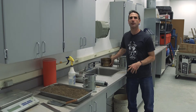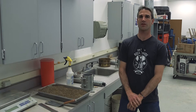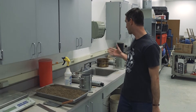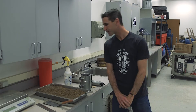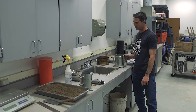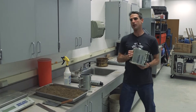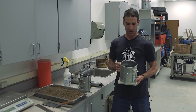Drying that soil sample is done at 140 degrees Fahrenheit maximum, or you can air dry it, but you dry it until it is friable. You pass it through either of those sieves depending on which method you are using. For T-99 and T-180 methods A, B, C, and D, your mold sizes are going to be dependent on which method you are prescribed to use.